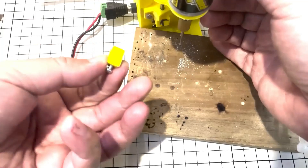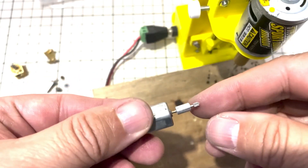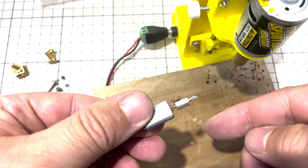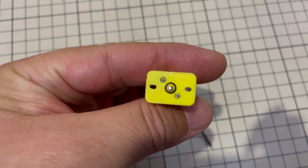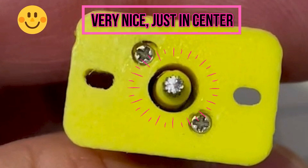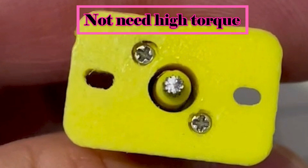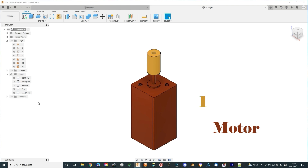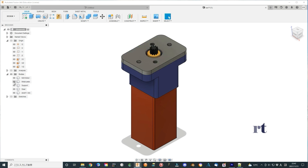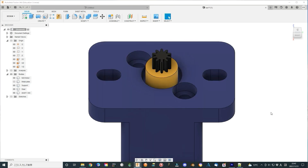I modify the top of the gear shaft and make a 1 mm aluminum connector. I insert the gear onto the motor shaft — if necessary, add some glue to fix them tight. It also seems not so precise, so finally I use a 3D printed 1 mm shaft and some glue to connect the gear and the motor shaft. It works very well since at this point high torque is not needed due to the high speed. I then design a simple structure that connects the motor to the gearbox, and you can adjust the position to fit the gear to the gearbox tightly.